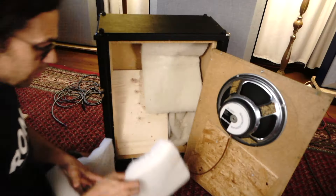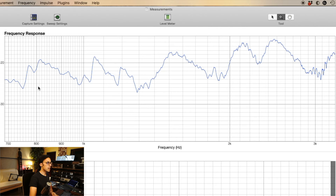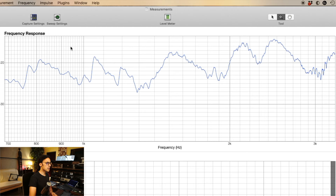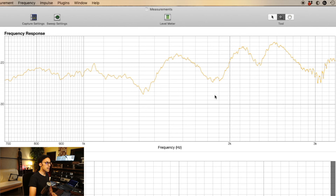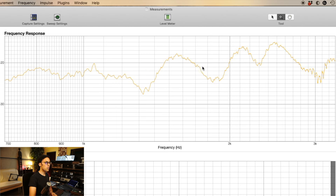Now let's open up the cabinet again and try something on top of this little change. We put in some acoustic wool, just like you would have inside a good studio or hi-fi speaker, and see how that changes the measurement. This is the empty cabinet, and this is with some wool inside. We can see that it further smooths the frequency response — without it, look at this; with, it's much smoother. Inserting this wool is a little bit like acoustically treating a real room — putting some absorbers on the walls and reducing echoes and cancellations. And this apparently works as well inside a speaker cabinet.